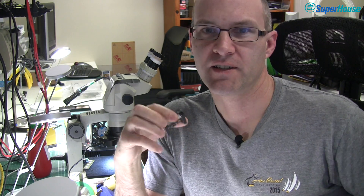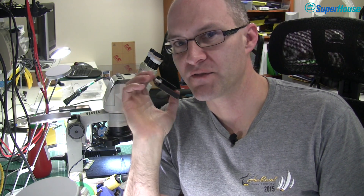I think one of these in a box with a LiPo cell as a battery backup could make a really nice little home automation controller — a good central system to run your whole house. I'm thinking of experimenting with that; I might even replace my current Raspberry Pi with one of these running OpenHAB and MQTT. This at first seems like a solution looking for a problem because we've already got bigger more powerful boards and smaller lower-power boards. But there are lots of projects where this really hits the sweet spot — it has the power management you need, it's fast enough, it's got enough storage but it's not overkill, and it doesn't take too much power.